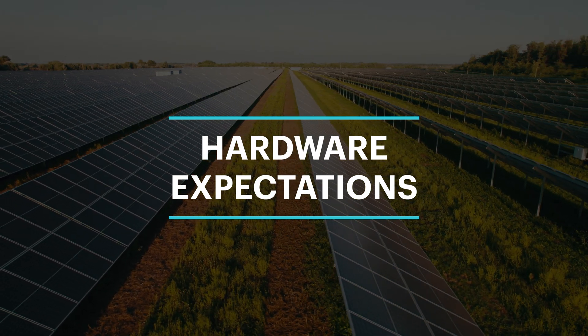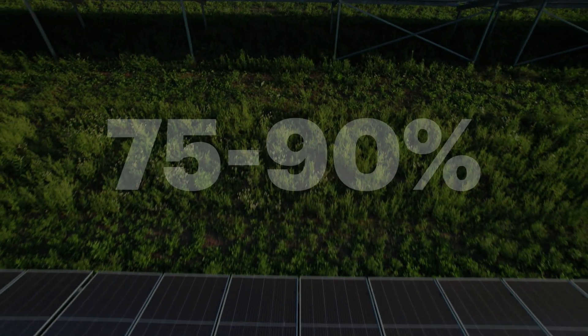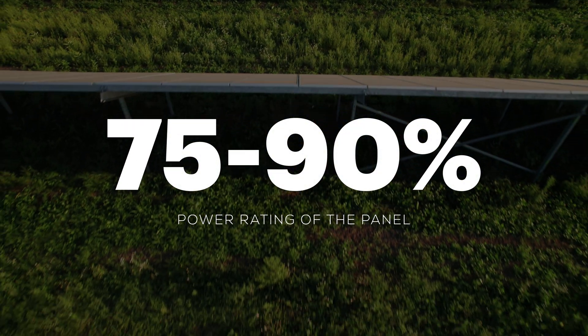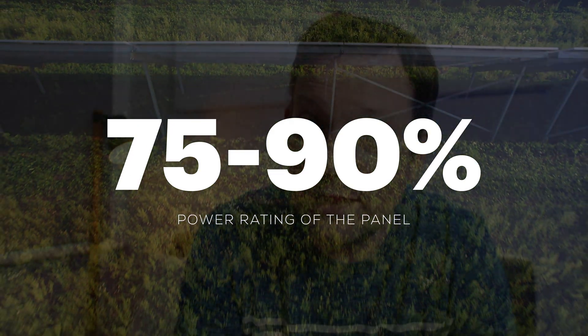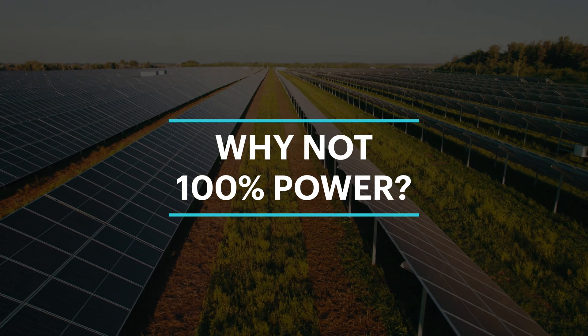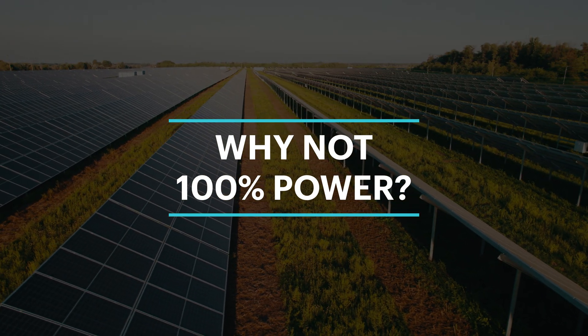Firstly, let's talk about the actual hardware itself. As a general rule, just to give you a rough figure, if you're getting anything between 75 and 90 percent of the rated capacity of the panel, you're doing pretty well. 75 would certainly be the lower side in good sunlight and good conditions, and 90 percent would be absolutely excellent. So why not 100 percent? If you're going to get a 400 watt panel, why can't you get 400 watts from it?